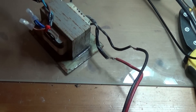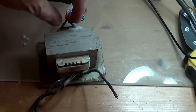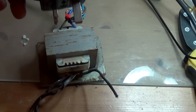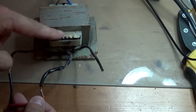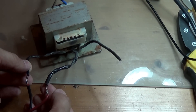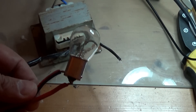This is what I got out of the car battery charger — this transformer here. We have the live, neutral, and earth from the 230V mains going straight into a plug that goes into the wall. On the other side of the transformer, we've got three connections: the secondary is tapped in the middle, so we're only using half the secondary winding. That gives us a certain output voltage. From there, I've soldered on a 12V automotive light bulb as the load.